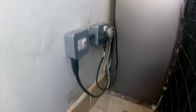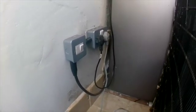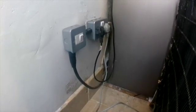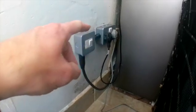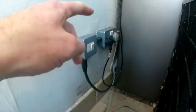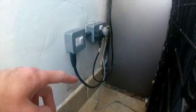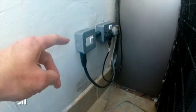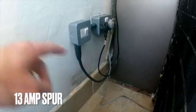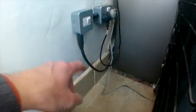Quite a few people have been asking about my garage wiring efforts, so this is a quick video to show you what I've done. This is a fused spur coming off the ring main. That was a single socket before, and the fridge and freezer had an extension lead with both coming out of a single plug, so I've put a double plug in. I've connected the fused spur and we've got a steel wire armour cable running underneath.